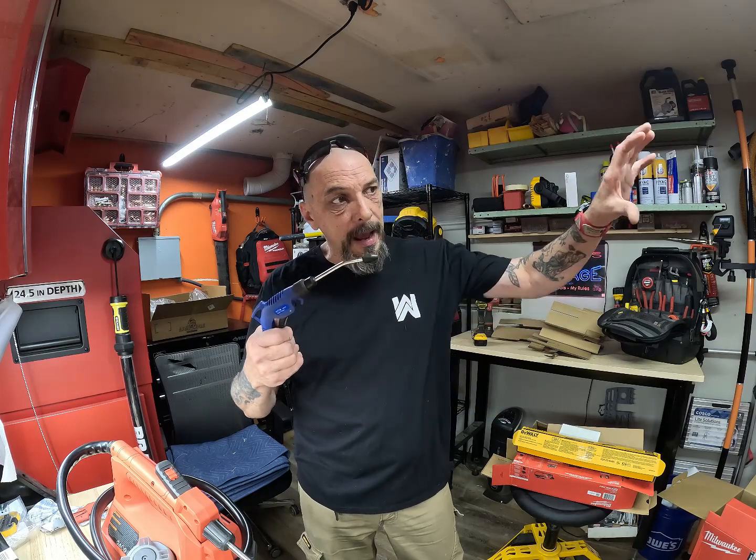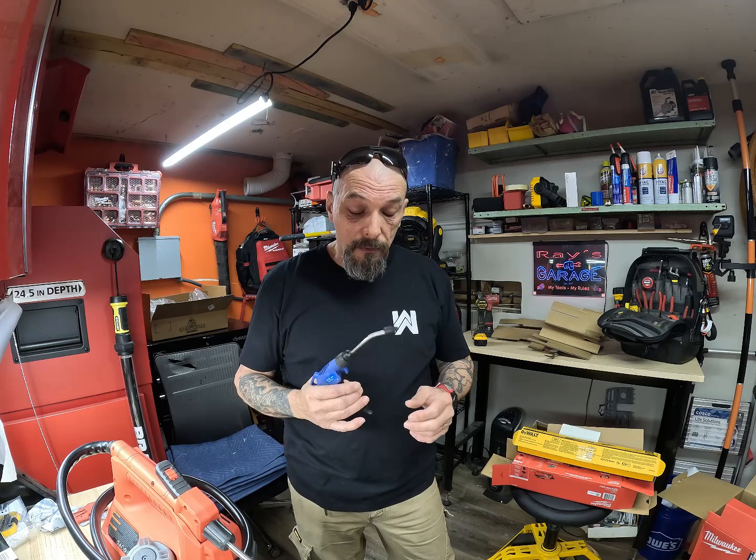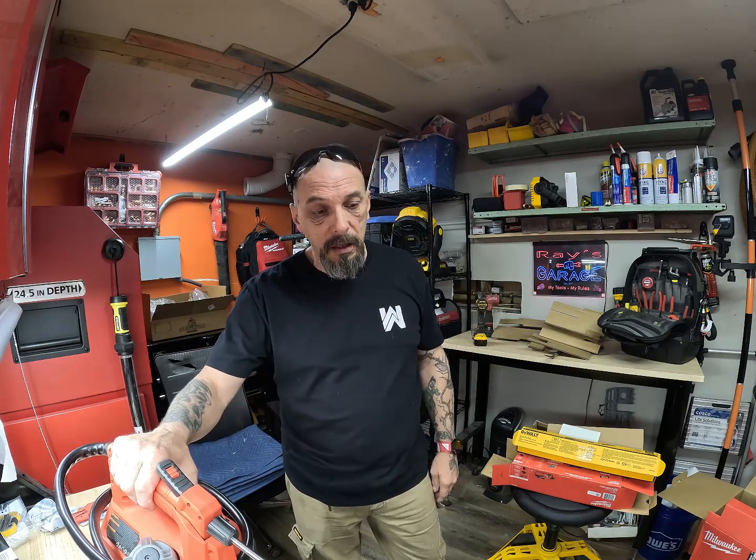And then I have to spray air through the coil to push all that debris through the coil, because they're not like your normal A coil where you're catching stuff underneath it. No, these are flat coils at a slant. And it's just, everything gets on it, and years and years of just abuse. No one taking care of it.